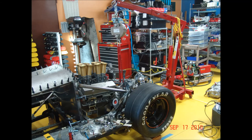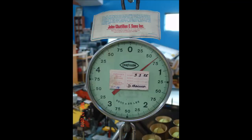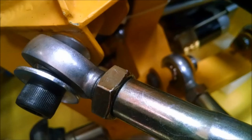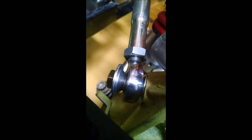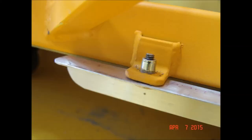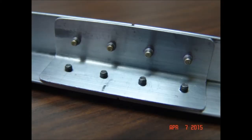At this point I thought I'd check what the whole thing weighs. I used a Dillon dynamometer — just a weight gauge — and lifted it with my engine hoist to get the result. Most of the suspension mounting hardware is in double shear, and where it has to be in single shear, I used extremely heavy-duty fasteners. The washers are required to keep the ball from pulling out of the housing. I added a couple of air dams longitudinally across the bottom to keep airflow running under the car rather than letting it spill out, made of angle and splice since I didn't have long enough pieces for one piece.